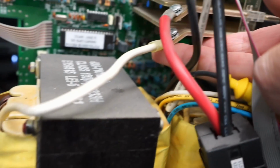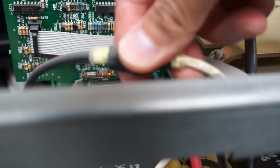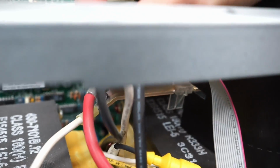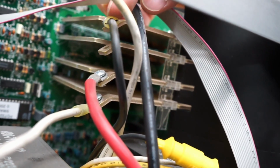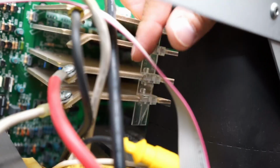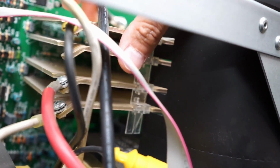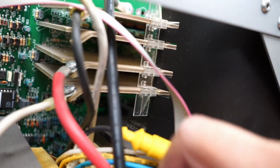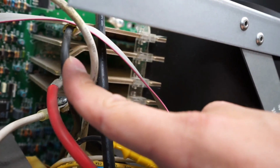This right here is where one of the transformers hooks up to. The other one, it's connected in series with the other transformers, so very high current transformers. And that's where the other terminal of the other transformer goes. So I believe that the MOSFETs mounted on these heat sinks are not just used for switching the transformers to produce an output voltage, but they're also used as the rectifiers for charging.